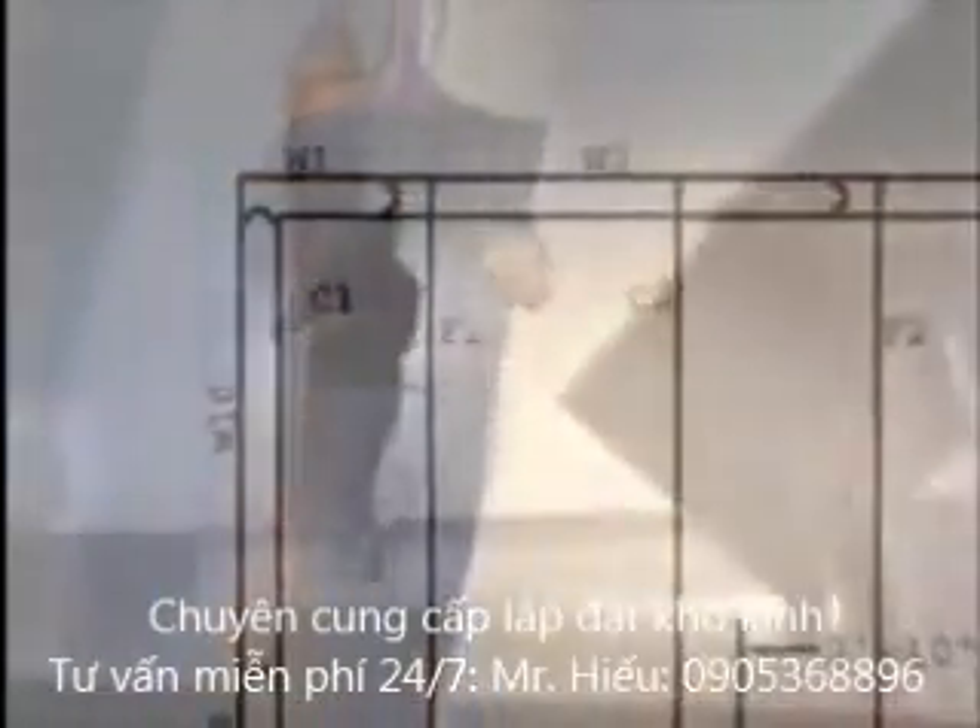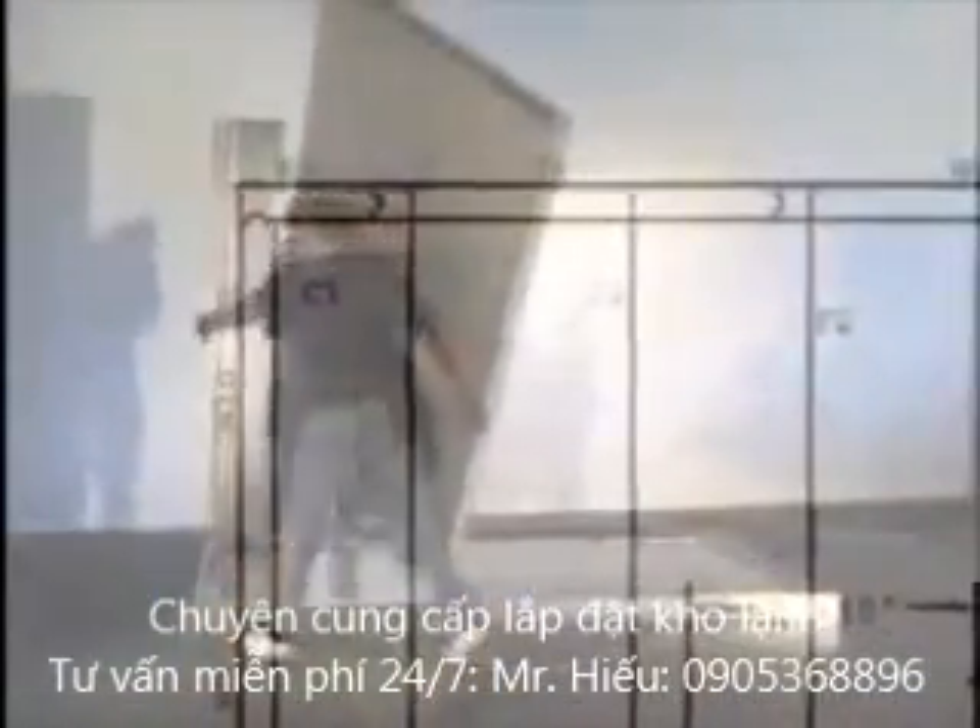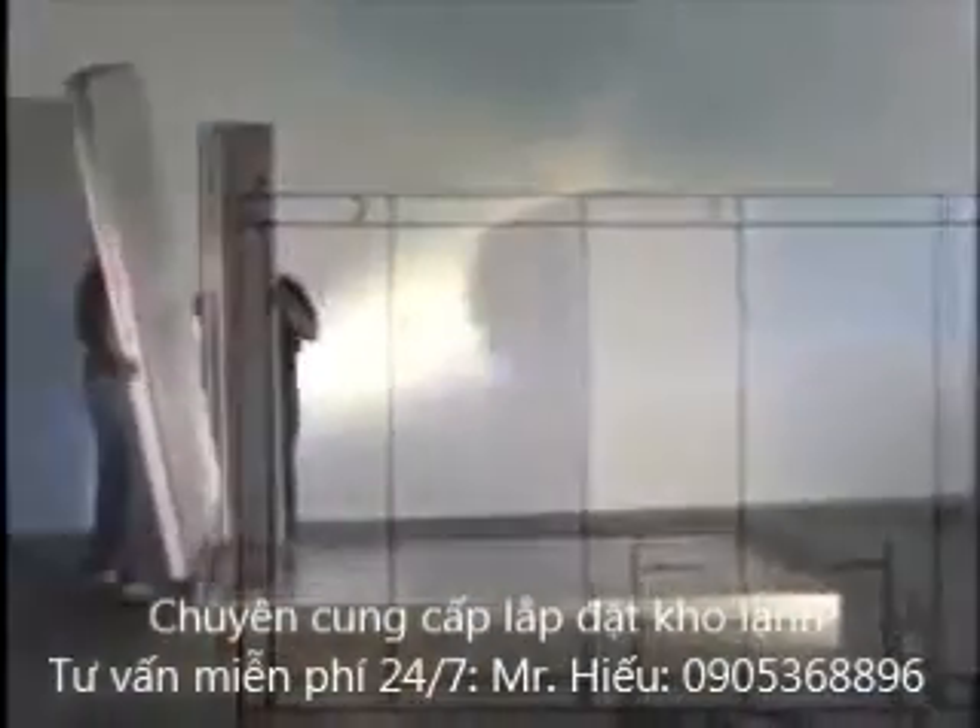The floor location for each panel is indicated along its groove. An arrow indicates the floor direction. Assemble the W1 panel, which is the first wall panel, and the adjacent corner panel, the last numbered wall panel, to form a corner.